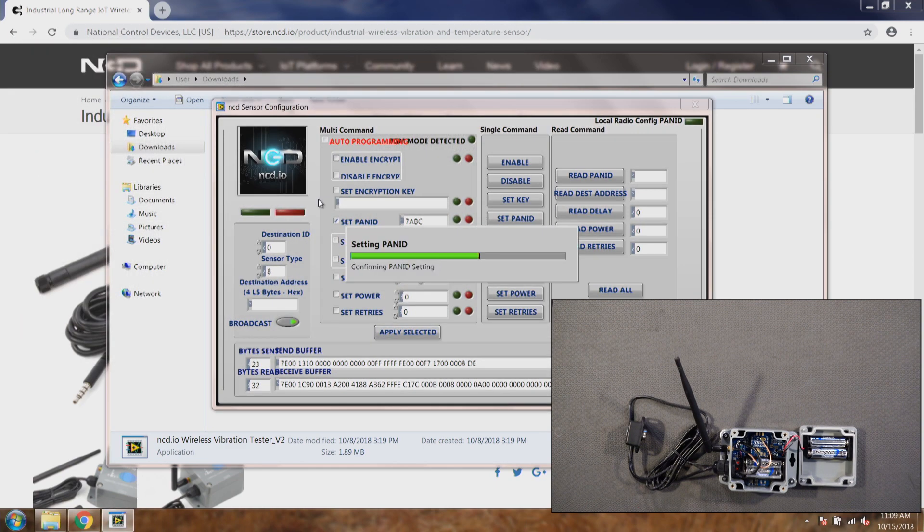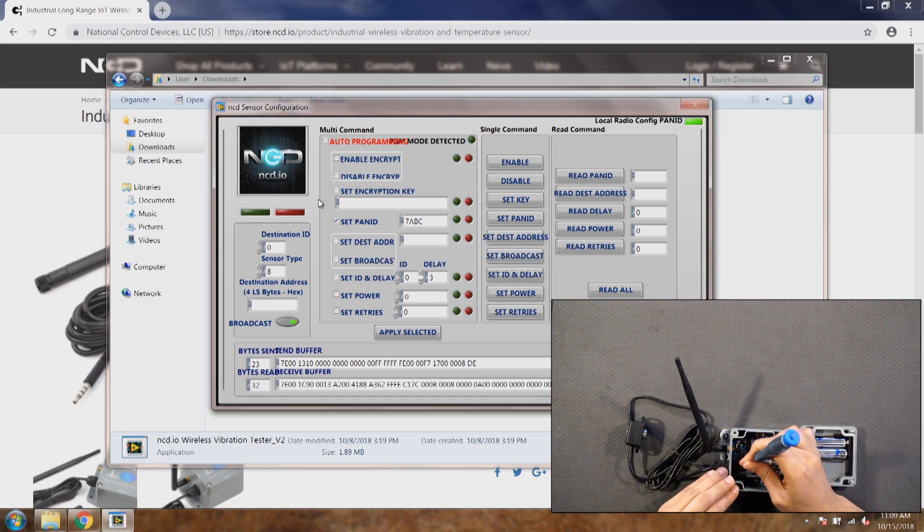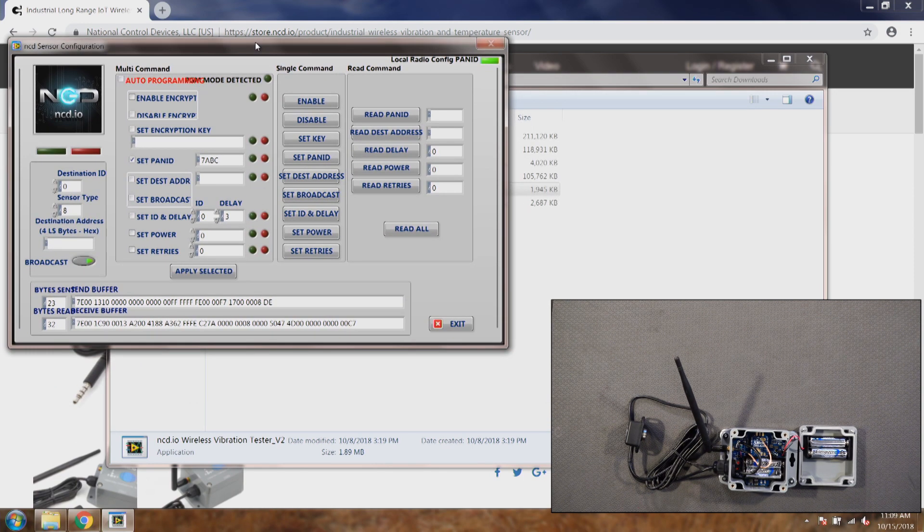I'll click on sensor configuration and put this into configuration mode. Right now the sensor is in configuration mode. I'll go and look at disabling the encryption, but I will not do that right now because once encryption settings differ between this device and the router they will not communicate at all — they must have the same encryption key and both must have it enabled. If you do end up with a mismatched encryption key, the final options are either a factory reset or pulling out the modem and using XCTU with the default settings files downloadable from our website to re-upload to the wireless module.